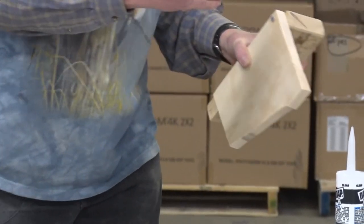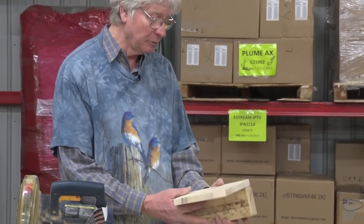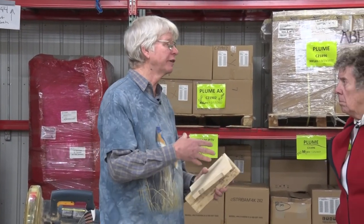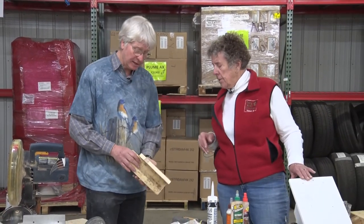You don't want to wrench that screw all the way into the wood. You want to make it stop just on the outside of the wood. Why? Because if you go too far in, you can split the outer edge of that wood. You're talking to someone who doesn't understand that, so I got that now.